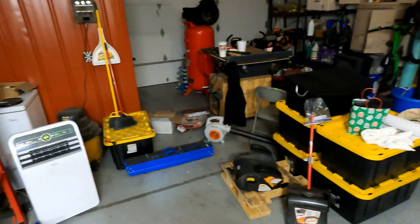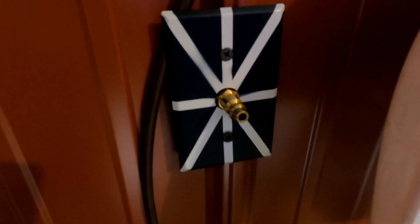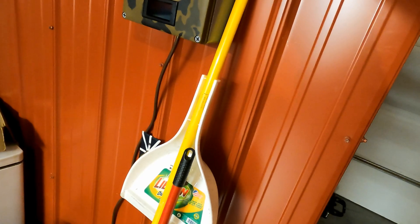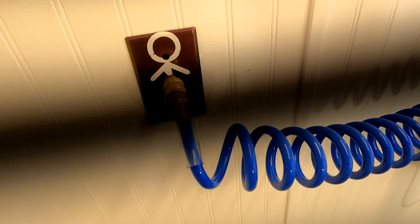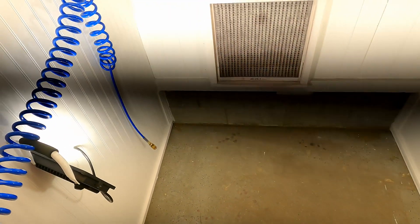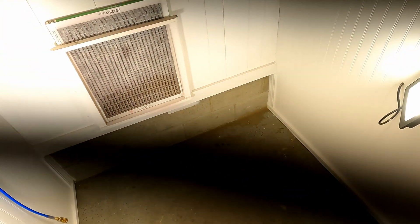I don't run my hose reel directly to these — I built my own little spray booth over here. Right here I have an air inlet that goes through the wall. The air from the outside comes in right here and then it goes through this coiled air hose, which I keep off the ground. Anyone who uses air hoses knows that as they drag along the ground they get incredibly dirty. I keep this off the ground, and this is where I plug in my HVLP spray guns.